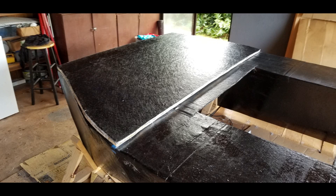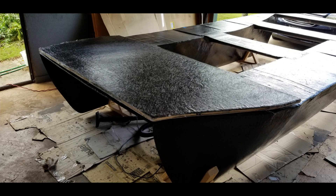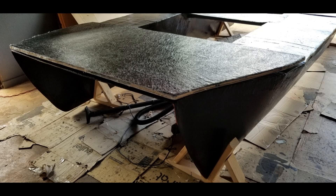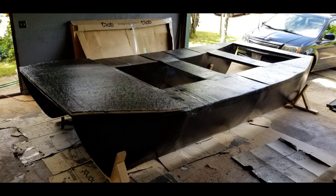Here's the first panel trimmed and sanded and dry fit in place. As the panels come out they're all going to be leveled out. The pontoons have a nice curve to them so the challenge is going to be to level these out. Here you can see the foam core sandwich that makes this so strong. Each one of these panels has to be made separately because the pontoons are a little bit uneven, so each shape is going to be its own unique piece.